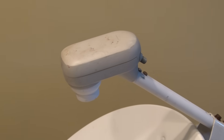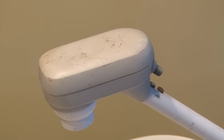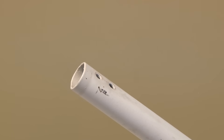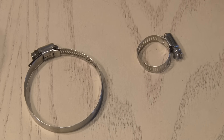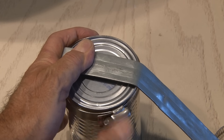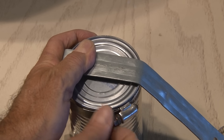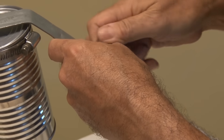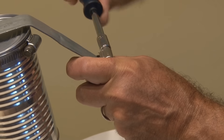The first step is to get to the LNB, or the Low Noise Block Down Converter. This is what collects the signal from the dish. I'm going to remove the two screws that hold it in place and remove that LNB. Back out to my garage, where I found this old galvanized pipe bracket with metal that bends pretty good, so I'm going to be using this for the bracket. We'll also need a couple of hose clamps. After bending the bracket in shape, I'm going to place it over the can, and using the hose clamp, I'm going to tighten it down and secure it to the can. And the other smaller hose clamp will hold the other end of the bracket to the existing mount on the dish.